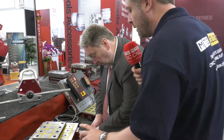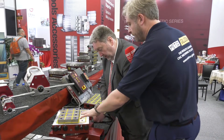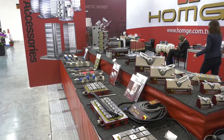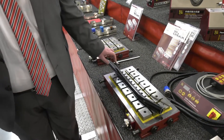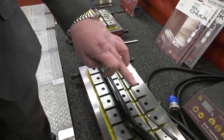I'm also thinking — you've got this plate here, which like the sacrificial plate, like a soft jaw — and different sizes? Yes, different sizes. If we go around the other side I'll show you one. This is another different example of how we would accommodate a workpiece. These are soft jaws. We've machined a profile into them to hold this tube — in fact, to hold two tubes.